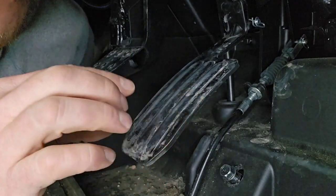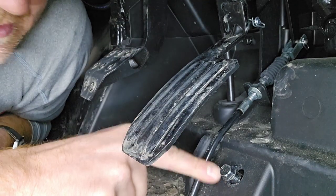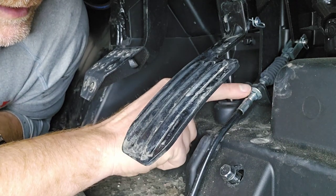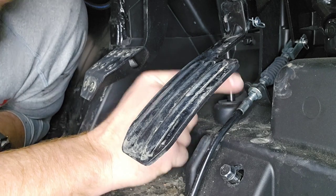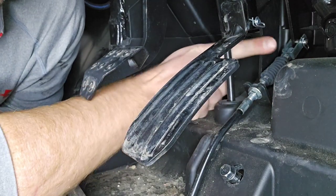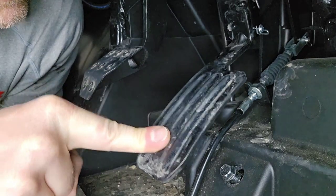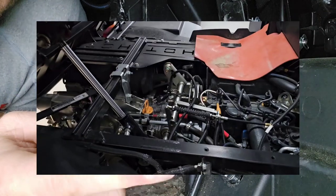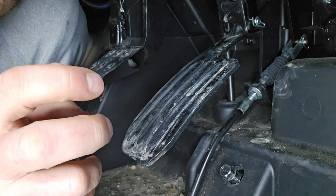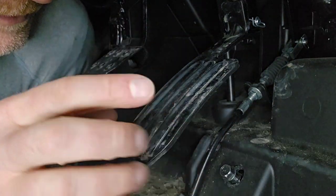There are two adjustments on this foot pedal — the accelerator pedal. I'm sure everybody sees this screw here and maybe you're wondering what it's for. We'll get to that in a second. This linkage here is probably first on the list. When you press on this gas pedal, it starts pulling on this cable, and that does two things in the back: it operates your HST — hydrostatic transmission — and it also accelerates the fuel in the engine, giving the engine more fuel while giving the transmission forward motion.